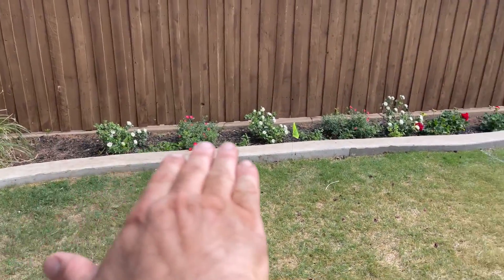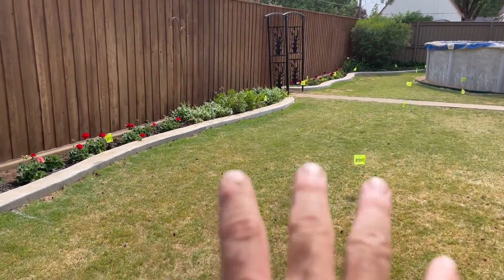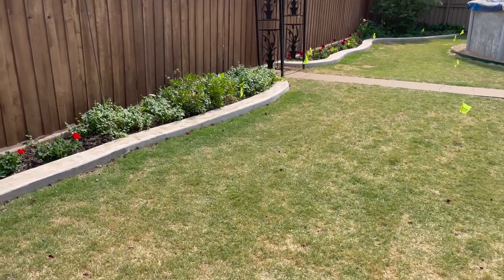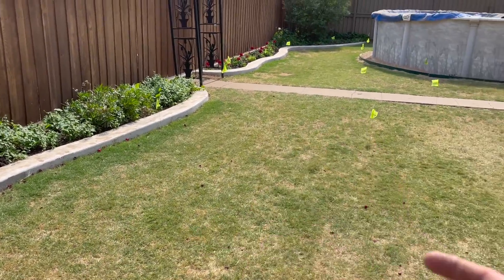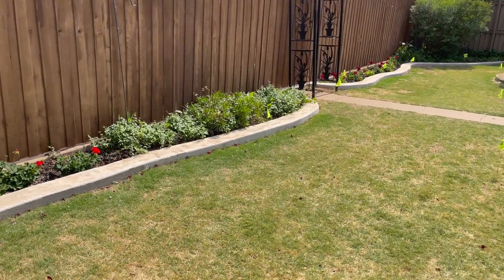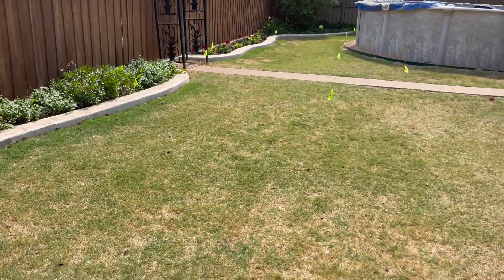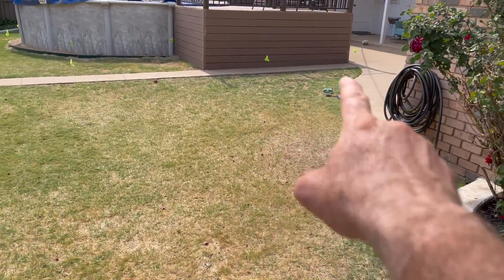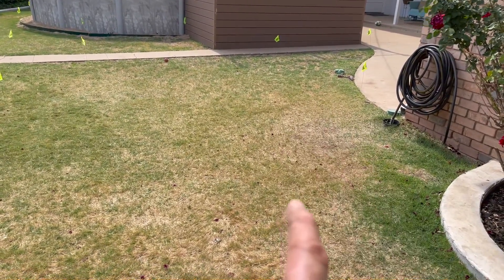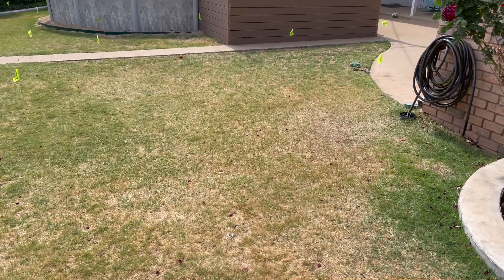In this particular yard, they've got this nice little flower bed that they look at the most. So really the last place I think I need to put this valve box is right out there in the middle where they're looking from their back porch or up by their pool and looking at a valve box. Nobody really wants to do that. Around this bed is not a good place, and right off their back porch, no one wants to walk out and look at that. In fact, I've had people make me move valves because we didn't think about it — and that's why I'm making this video.